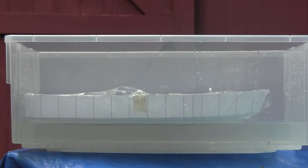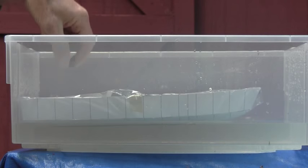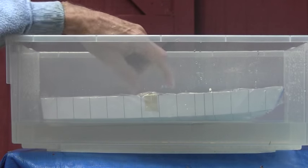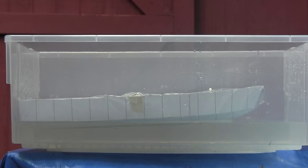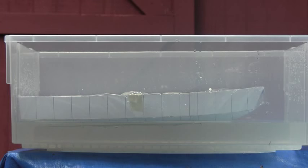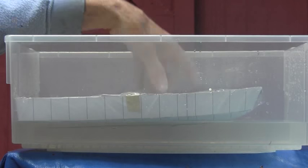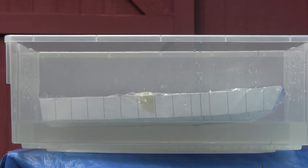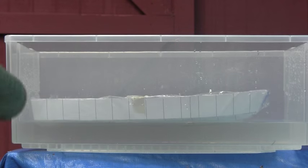Let's put some Penny Brothers in — Canadians! Let's see where the small one is. Put an outboard on the transom — that makes it squat a little bit. You can see how the transom went down, but the sides are still up. Put the biggest guy there and a buddy over here — that brings it back down a little flatter. If you've got a fuel tank or this guy closer to the bow, depending on your seating setup, with a guy back here and a guy up front you're pretty much level again.